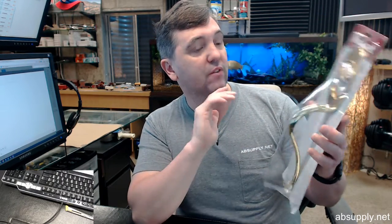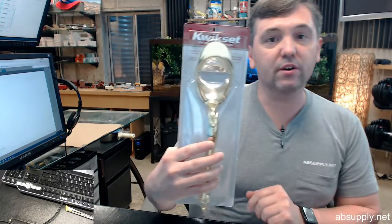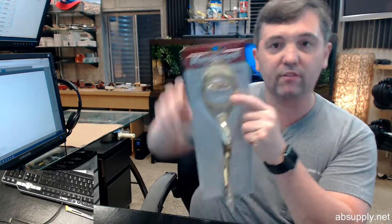This curved handle, I don't know how many decades it's been in existence, but I can attest to 30 for sure that this has been around. A very common item that people use when they want to dress up the door and make it look a bit more elegant. Just a common knob lock where they will remove the lock from the door, stick this curved handle underneath, install the lock back through the door, assuming you have a deadbolt up above, and it gives the door a more elegant look. And you've done so without spending a lot of money.